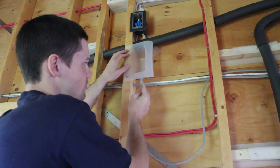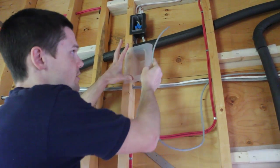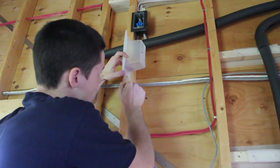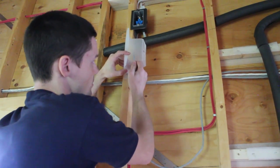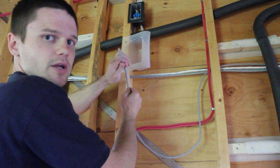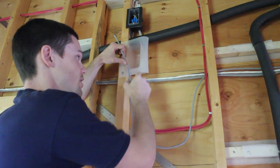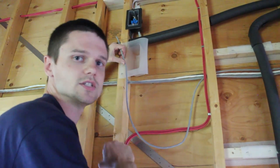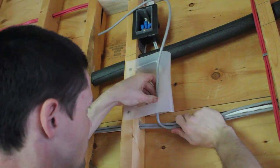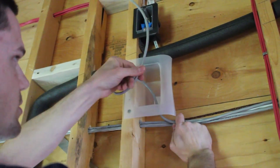There are a couple spots where we're going to enter the 12-volt cabling into a vapor boot. This is where we're going to have a dehumidifier, probably powered off 12 volts. What I'm going to do is cut the tiniest little hole on the bottom and then ram the cabling through to enlarge the hole, so the plastic stays tight around the cabling. If it tears or we want to make it better, we can just put a little bit of putty in there to keep the vapor seal. Then I'm just going to zip tie it right where I'm holding it and coil this up inside.